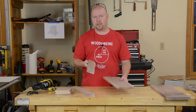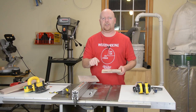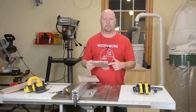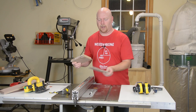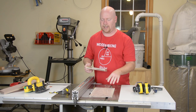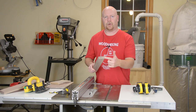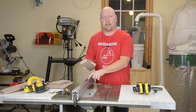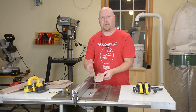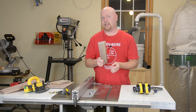To make my own life a little easier, I'm going to cut the rabbets in this rail stock before I start cutting all the miters and making a frame out of it. I like using the dado stack for these kinds of rabbets because it lets you sneak up on the two dimensions of the rabbet sort of independently. The height of the dado set is set equal to the thickness of the wood I'm insetting, plus a skosh to let me flush it up later. The other dimension is set by the fence, and I can use test pieces and sneak up on it, moving the fence back and forth by just a thousandth of an inch if need be, until I get it exactly where I want it.